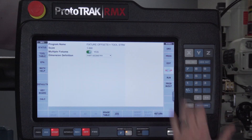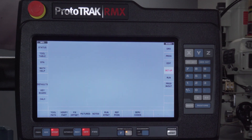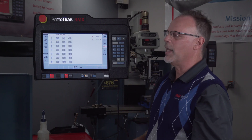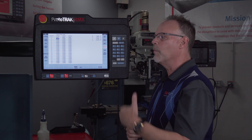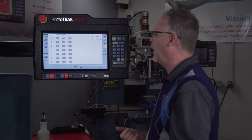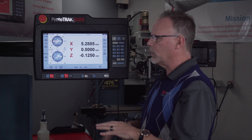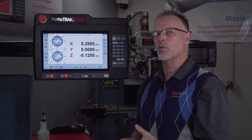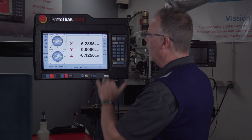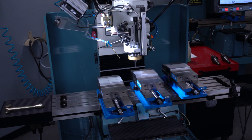Next I'm going to show you how this works. When I go into setup mode, I have my fixture offset table and everything is set at zero. From the main setup screen, the third button says fixture offsets. You'll notice that fixture number one says 'base' — all of my fixture offsets are going to come from my first fixture, which I'm going to make the part on the very left. Before I do that, I first need to set where my first fixture is.